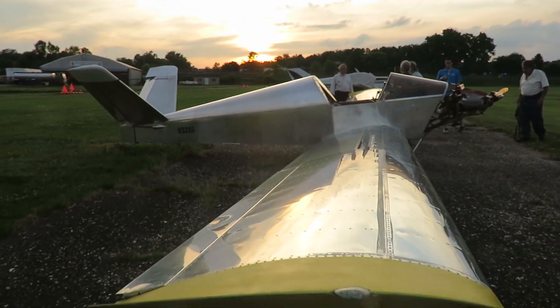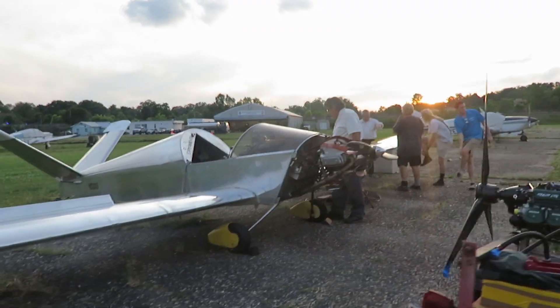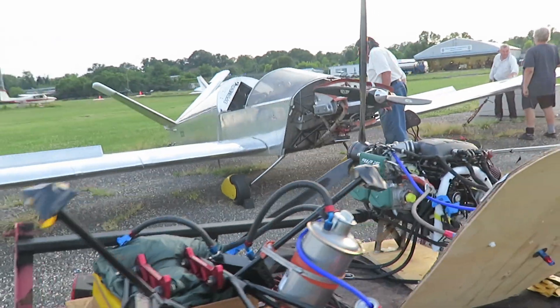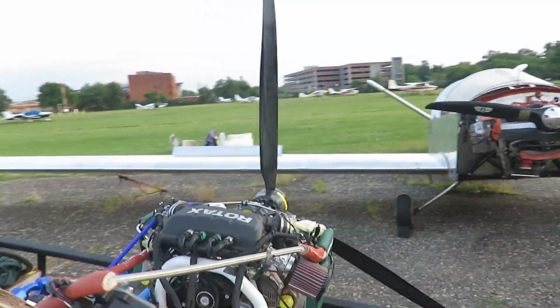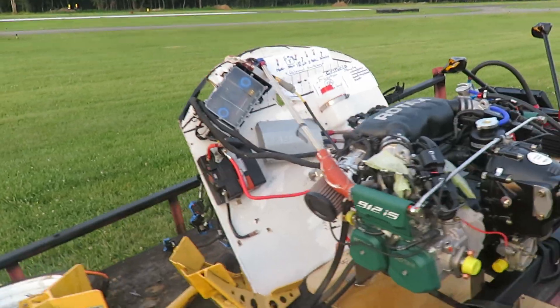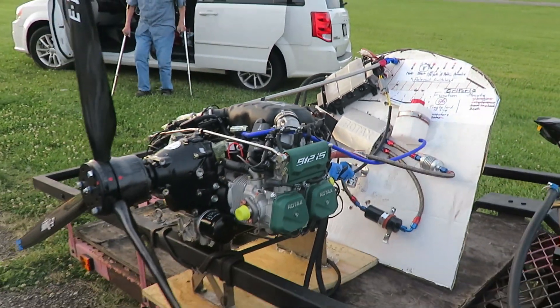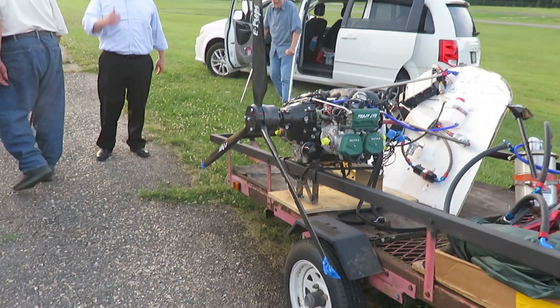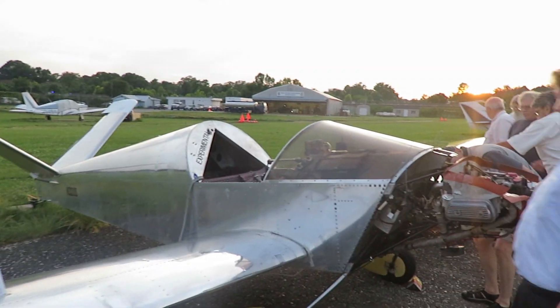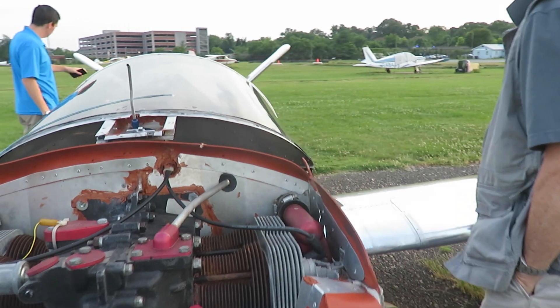It has a probably 25-year-old — manufactured 25 years ago — Beetle VW, 2-liter flat-four air-cooled, that has been rebuilt with electronic ignition and most of the other changes you'd make if you were going to convert. The VW is a fairly popular engine, but it's carbureted and it's a little bit of a tuning nightmare. So I'm going to replace it with a Rotax 912 IS Sport.